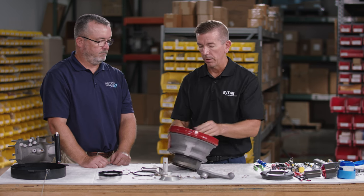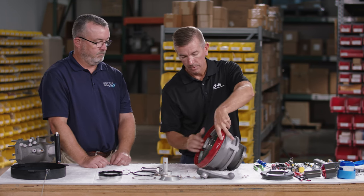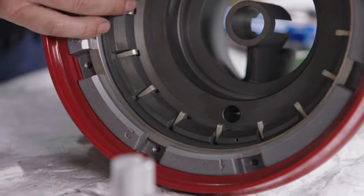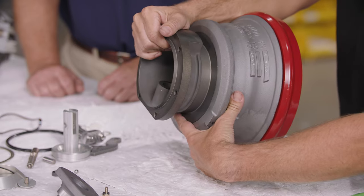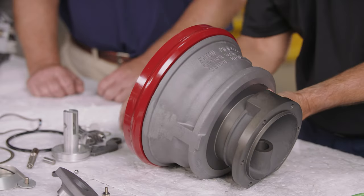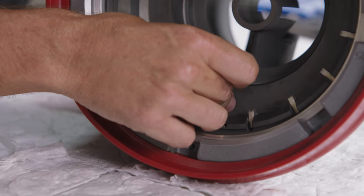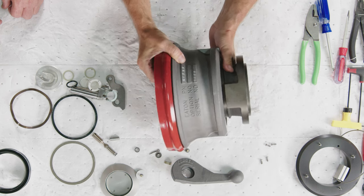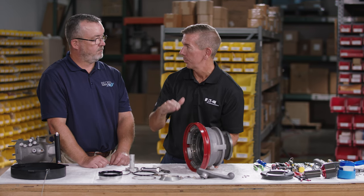Install the detent ball and pin. Put the detent pin hole on the bottom side, place a finger on the backside of the hole to catch the ball, and push the detent ball into the hole. Slide the coupler back and forth until the ball seats — you can confirm this by shining a flashlight through the hole to see the ball has dropped into position.